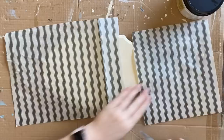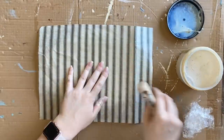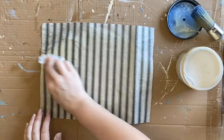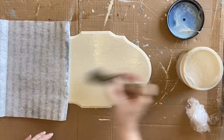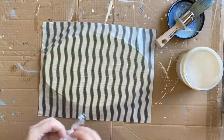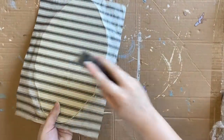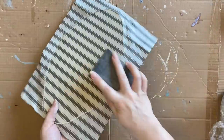I'm going to be decoupaging with Dixie Bell's flat clear coat. To begin, I'm doing an anchor strip — a small amount of product placed down first — and then securing my paper. I'm smoothing it out with a ball of cling wrap and using a mister where I find the paper pulling. I'm then applying the rest of my clear coat and carefully smoothing out the wrinkles. I still have some wrinkles, but I'm not worried — a lot will disappear as the paper dries. Once dry, I'm using a 220-grit sandpaper block to sand in a downward motion against my paper, giving me a lovely clean line.